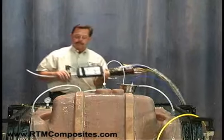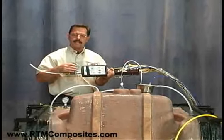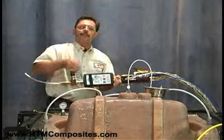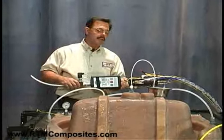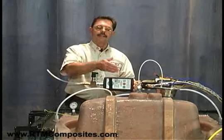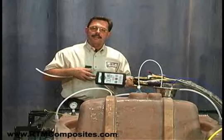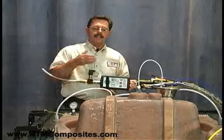We do all the controls back at the mix head. While we are looking for pressure and vacuum sensing, we do that right here with a very precise electronic sensor, but it doesn't need to be one connected to every mold. Years ago we did it that way, and we've learned one sensor connected here communicates all the information we need — keeping all the wires on the mix head, not connected to the mold system, simplifying it as much as possible.